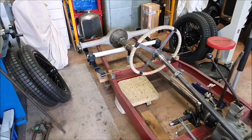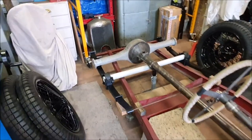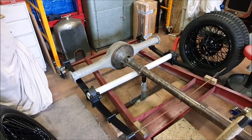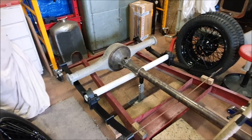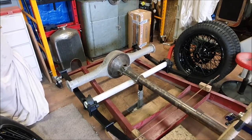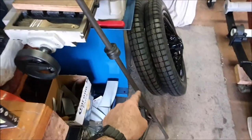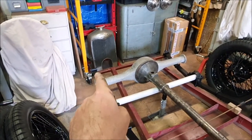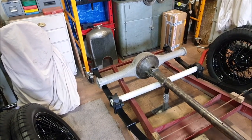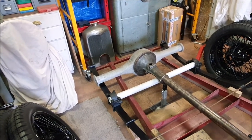I finally have this all back together and it's looking a lot better now, but it was quite a struggle. It turns out that loctite works really, really well — I had to use heat and big hammers. The first pin I had to get out by putting a large flat washer on it with a couple of nuts, then punching it out with a drift. The second one I was able to use my big long steel bar, sliding it through the tube and hammering on that, which made it a little bit easier, but it still took multiple rounds of heating and hammering.